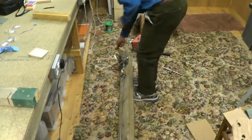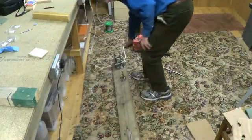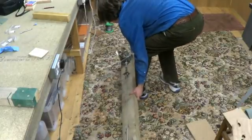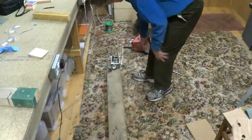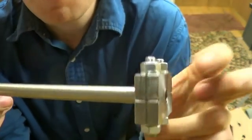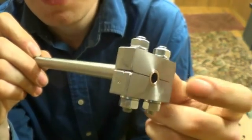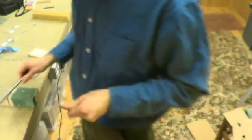Watch it - it doesn't spring off the end. I think the problem is pulling it through the end, because the end is clamped with the split clamp here and the tubing can't expand because of that. So shoving the swaging plug through that section is quite stiff. But it seems to make it, so let's keep going - we'll put it through a second time.